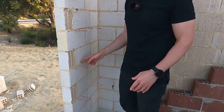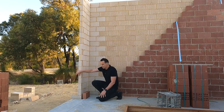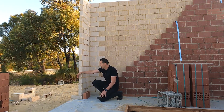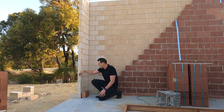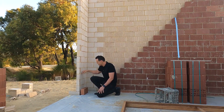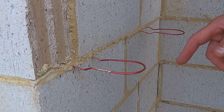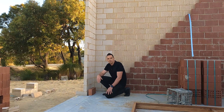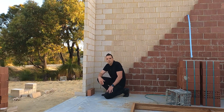If you come over and have a look, you can see there's a little kink in the brick tie here. What that is: when rain, water, and damp actually hits your external course and starts to penetrate through the brickwork, if there's enough moisture coming through and it makes it to this side of the brick, it'll work its way along the brick tie, come down this little dip, and drip into your cavity and then out through your weephole courses. It's a really simple method to keep water out of your house, but it actually works. That's a little tip on double brick construction, and we've got more tips soon.